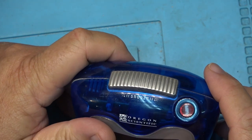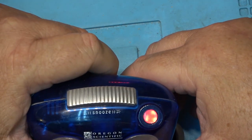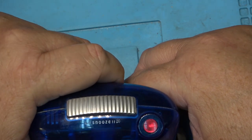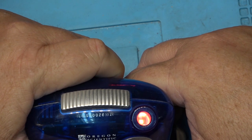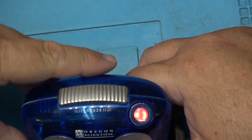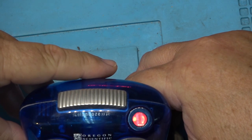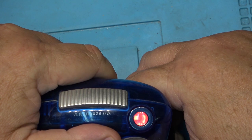As you can see, it just finished trying to do its sync cycle and didn't complete, so there's no antenna shown. As far as the time display goes, I can read the time — it's 3:25 — but the problem is the display looks like you are looking through bubbles. It looks like dirt but it's not dirt — it's actually the LCD that's gone bad. There are little microscopic bubbles in the liquid crystal which are obscuring the numbers. The light from the LED is probably also failing because this thing has been running constantly since I got it, probably since the late 1990s.